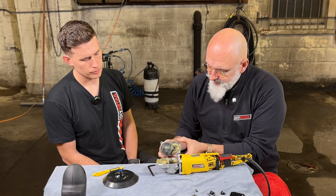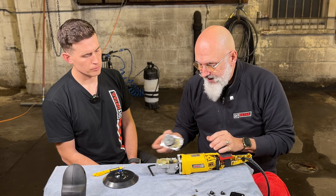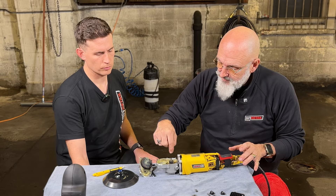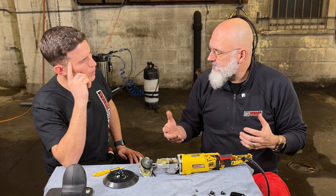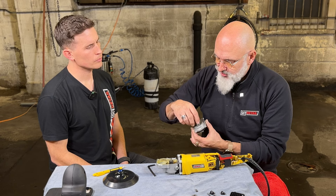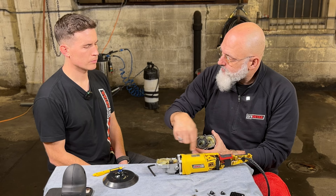The gear case itself has a double reduction gear. Most gears have a first reduction — about a four-and-a-half to one ratio — and then the spindle. We have NSK bearings throughout — NSK is a high-quality brand of bearing, not a cheap one. Instead of putting the spindle after just one reduction like most machines, we have a second gear reduction. So the motor turns quickly while the spindle turns slowly. This also enables us to achieve both a 600 RPM low end and a 2500 RPM high end — whereas many tools that start at 6 or 800 RPM rarely go over 2000 to 2200 RPM.